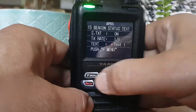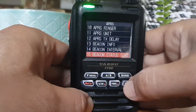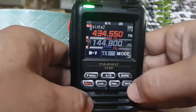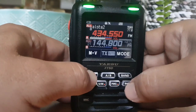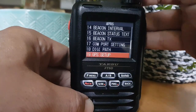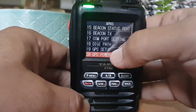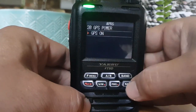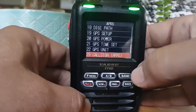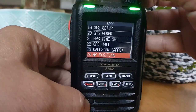That will come up on APRS.fi. Go back into the menu - hold F menu, APRS. Beacon TX we've done. Comport didn't change. GPS setup I haven't changed. Power - yeah, you need that on, so you need GPS lock on. GPS time that's auto. GPS unit haven't changed. APRS call sign - definitely important that you do that. I've done number dash 10 for now.